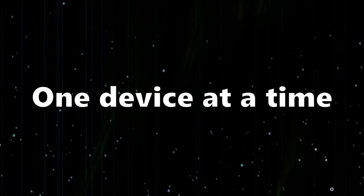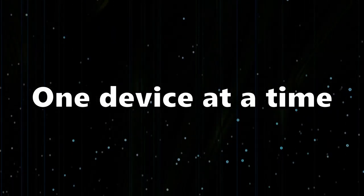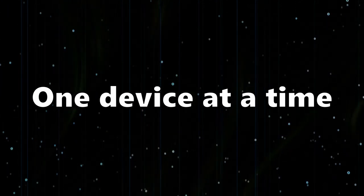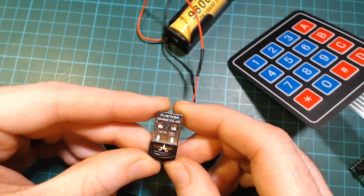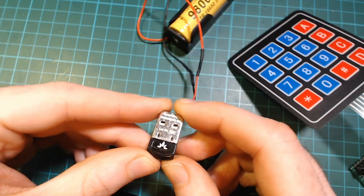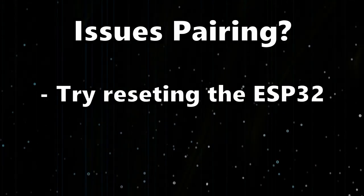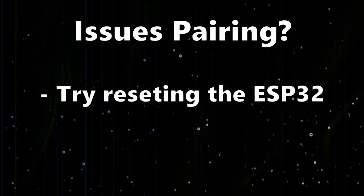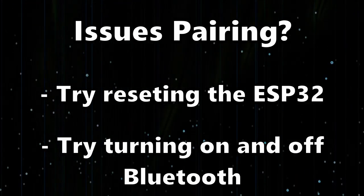One thing to note is that it can only be paired to one device at a time, so disconnect it from your phone first before trying to connect it to your PC. My PC does not have built-in Bluetooth, so I just use a USB dongle, which I'll link below. If you're having some issues pairing, try restarting the ESP32 while your device is searching. I also once had to turn on and off the Bluetooth of my PC to get it to pair.